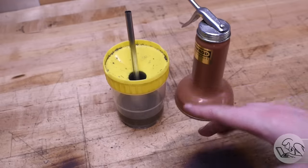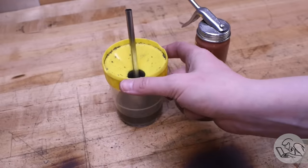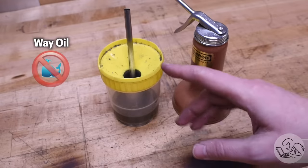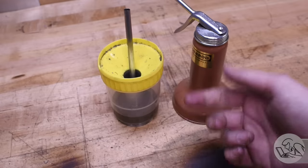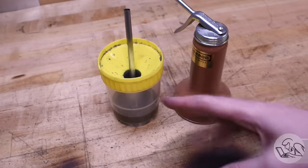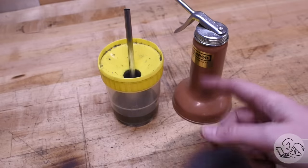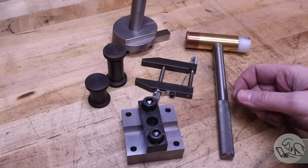Don't forget about fluids - there is a starter set of these that you will need as well. You're going to need at least cutting oil - this is Tap Magic - and you're going to need way oil, which is ISO 68 oil, for your lathe. Don't forget lubricant for the machine itself: you may have a gearbox in the carriage, the headstock, or a quick change gearbox that needs lubricant. Make sure you have that on hand because you may want to change the factory oil - who knows what they put in it - and you will need to change the oil at some point, just like you do in a car.